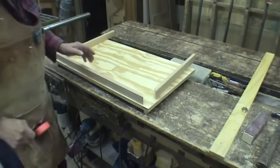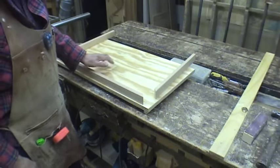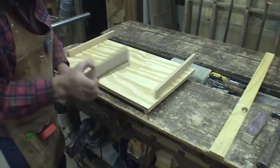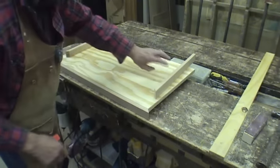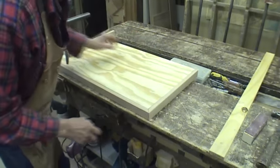What I want to show you now is how to make a nice laminate top — a counter top or a table top — with the wood edge. The wood edge is inch and a half wide here and about three quarters thick, and I want to put that right on the edge on three sides, because the back is going up against the wall and I don't need anything there.